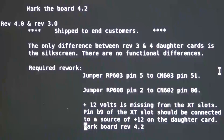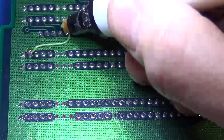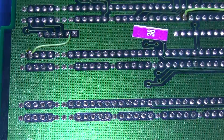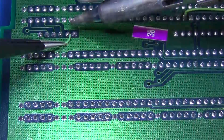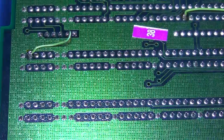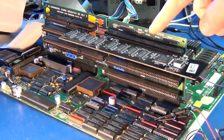My next step is to remove the rework from that pin and try the XSurf 100 again to see if we can get it working. Let's drop a little flux down and disconnect one side of that rework for now just to see if we can move that connection. That should be good enough to test — I'll come back and clean that up in a bit. The daughterboard has been reinserted into the Amiga and I've reinstalled the Big Ram Plus. Now we're going to power it on and see what happens.